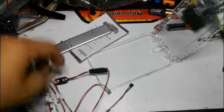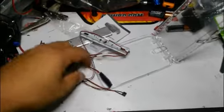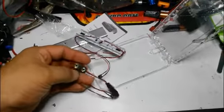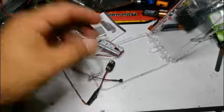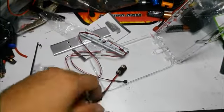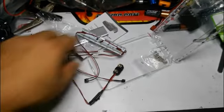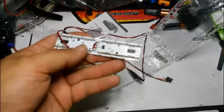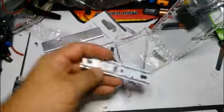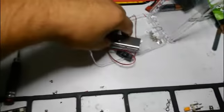I'll let you know how it works out. I'm going to be in-line with my LiPo — I run 2-cell and 3-cell, so it can go up to 11.1 volts, which is going to be extremely bright. Obviously the more power you put to it, the brighter it's going to get, which inevitably shortens the lifespan of the LEDs. But it's going to shine nice and bright, and that's what my son wanted. It seems like a very low profile — perfect for a drift car LED bar.